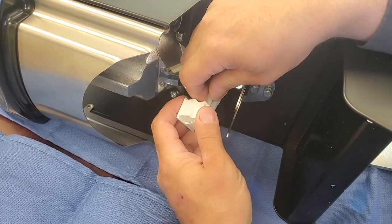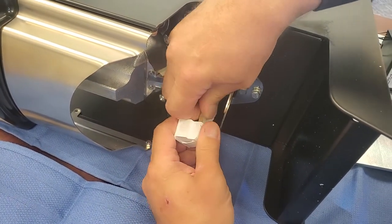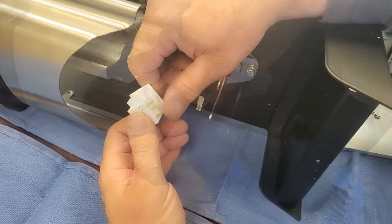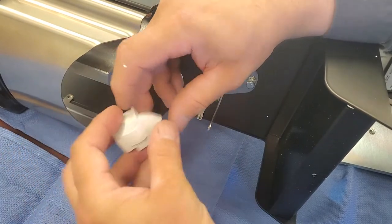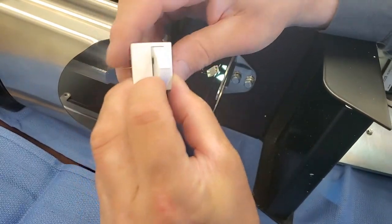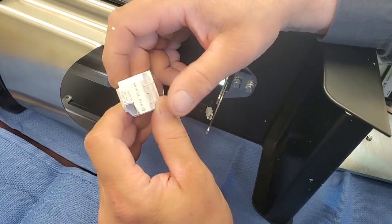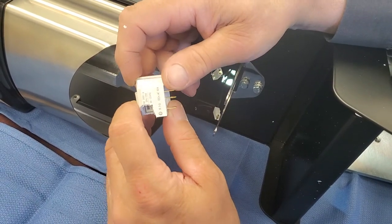Remember your wire positions — it is the middle and bottom terminals that the wires connect to. They can be reversed, but do not connect anything to the top. When connecting your wires, they only connect to the middle and bottom. Your switch will look like this: this is the top, this is the bottom. The wires can be switched around between middle and bottom — it doesn't matter which wire connects where — but the top terminal is not used.